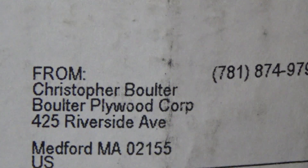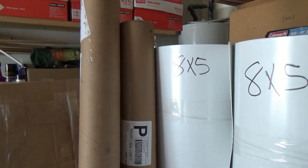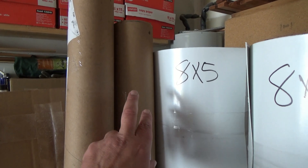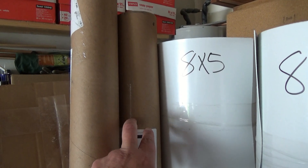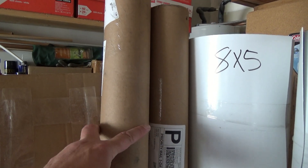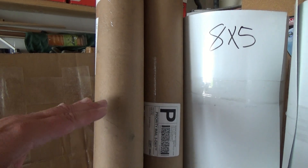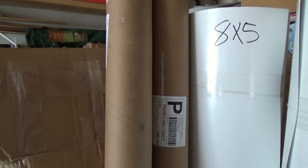They also offer 1/4 inch and different types of plywood. Next on my pre-purchased list, I got the Hurricane Hinge from Vintage Trailers — it's 5 feet wide, and my trailer is 4 feet so I'll have some extra to trim off. I also bought the 2-inch wide bendable trim that goes on the outside as a T-trim for the galley hatch, so that'll overlap the seal on the outside of the trailer.